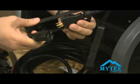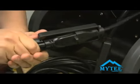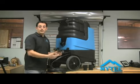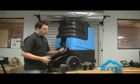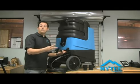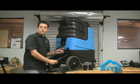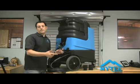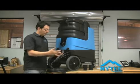Now go ahead and plug your cords in like normal. And then you just lock it into place. It's that simple. Now we've got two pigtails connected to two cords. Now you're going to notice there's one on the top, one on the bottom. The top cord controls your vacuum motor number 1, your vacuum motor number 2, and your pump out pump. The cord on the bottom is going to power your 1200 psi pump, your 220 psi pump, and your 2000 watt heater. So there's a lot of components, and we've got two cords.